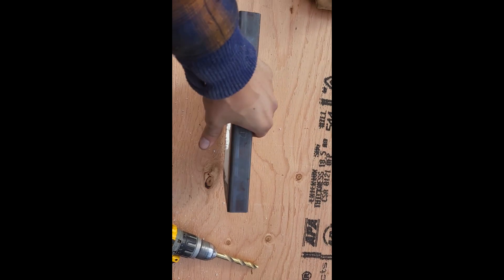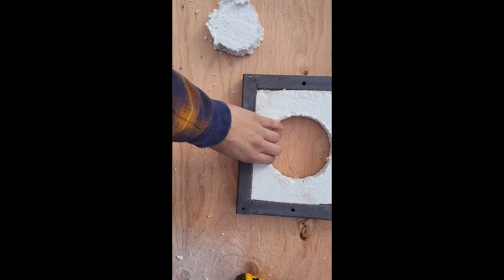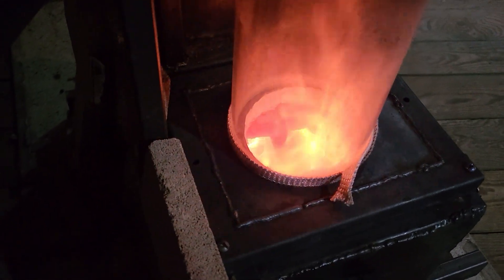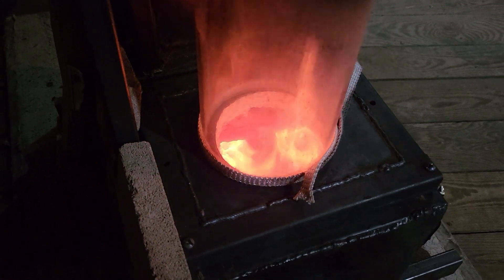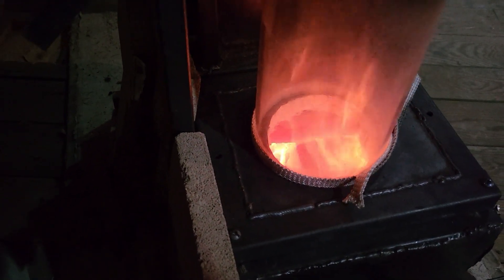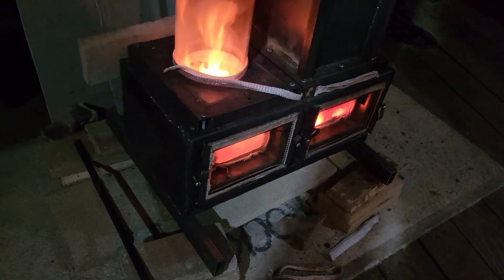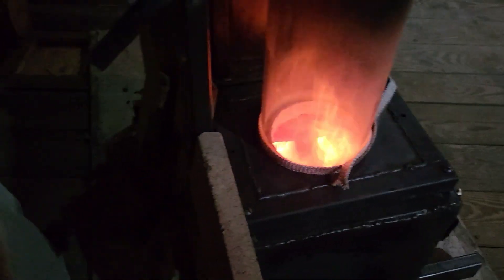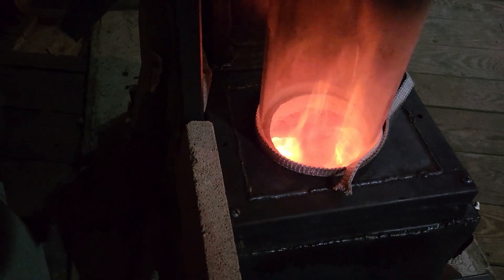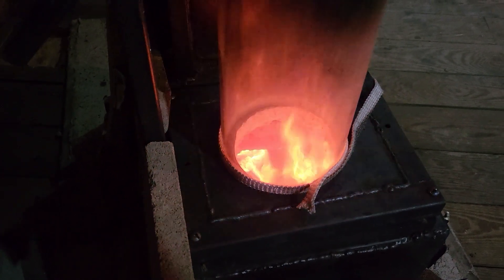Here's the lid just outside — put some ceramic fiberboard in there as a friction fit; we'll see what that does. With the extra insulation in there, you can kind of see in the back there a flame shooting across. It looks like it's helped the side that has less insulation — the glass side rather than fire brick stacked against steel — get a bit hotter. Still running a bit better, though I wouldn't say it's massively different. Small improvements will probably be it for the year on this one.